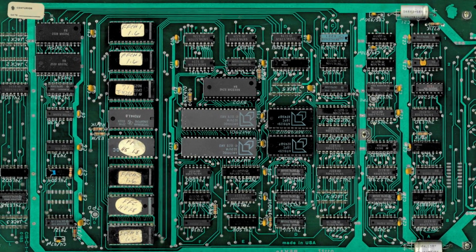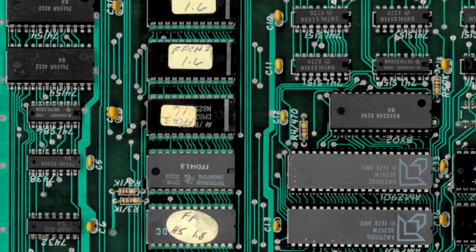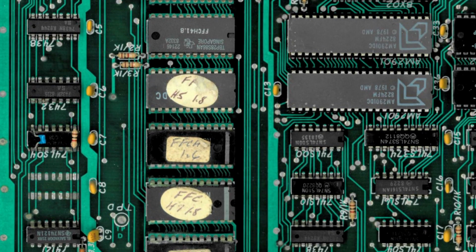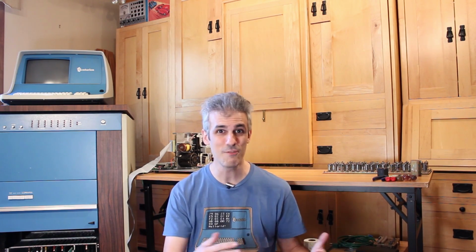And well, there's more than just one ROM chip on the FFC card. There's actually 8 ROM chips on there, which means that there are 64 individual control lines snaking throughout the entire system, controlling other pieces of hardware. So if we know what addresses we're stuck at, we can follow those 64 individual control lines to find out what pieces of hardware are being turned on or modified or changed in certain ways.